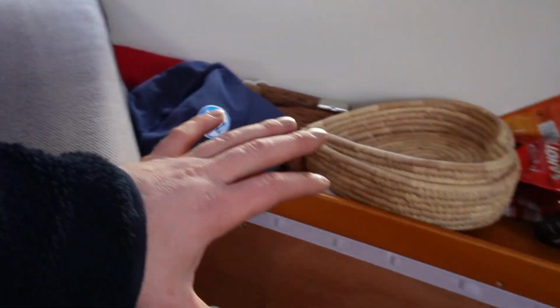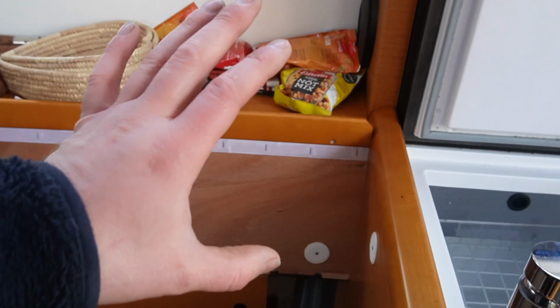So what makes this job a little bit stressful is that if you don't winterize everything to your best ability, you might have problems because the hoses are sometimes made of plastic, and that's no problem when you're sailing in the Caribbean. But here, that can be a major problem because that plastic can easily crack if you have water left in the hoses. Not only that, but all the hoses are, of course, laid behind all the panels here, all the way across the boat. So if you want to get to them to fix them, it could be a lot of work. So it's all about doing a good job now so that we don't have any problems when spring arrives and the customer just wants to get the boat on water and start using it.